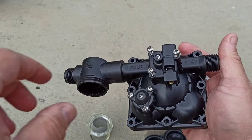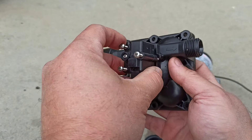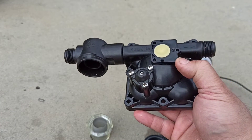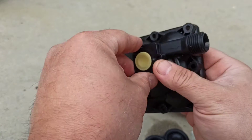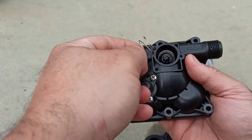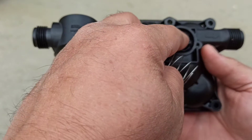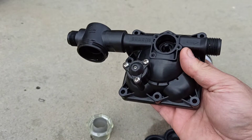Change of plans — we're going to take the check valve apart anyway. I could not get a brush in there to my satisfaction with just these three screws accessible. The back plate comes off, and you want to make sure you don't lose your spring when you open it up, and don't lose any O-rings. Take it all out and give it a good scrub down before putting it back together and testing it.